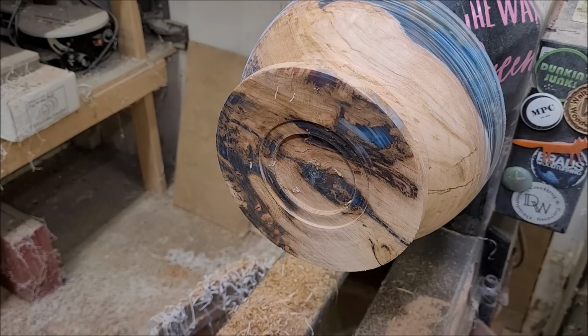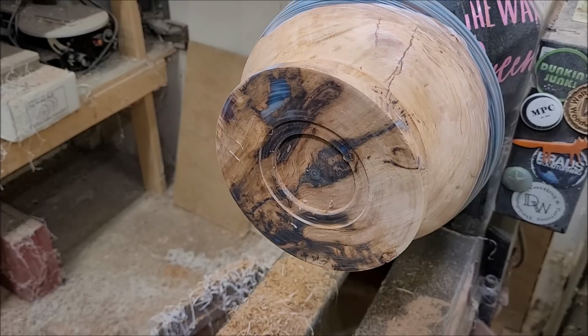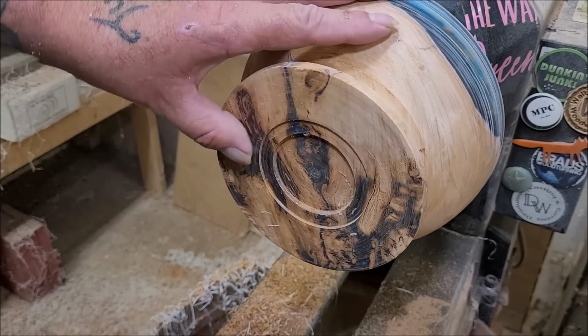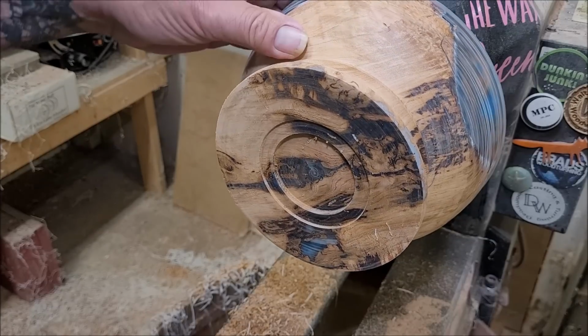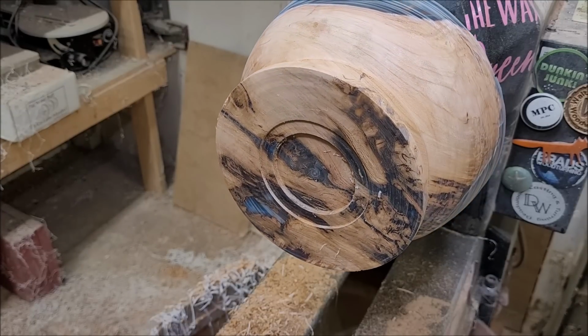Alright, I'm going to sand 80 to 800. Maybe not that far. I'm going to put a resin coat on it, I think. That's why I did this, so that I can not have the dead spots when I brush it in there. So maybe 320 I'll go to instead of 800. 800 is just a force of habit to say. So, yeah, let me get this sanded. I'll show you 80.